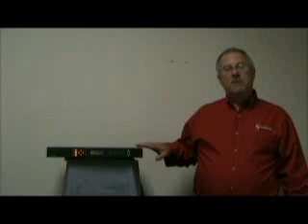From a power standpoint, this unit can be powered via AC, which is approximately 90 to 240 volts, 50-60 Hz. Or you can go with a DC option — there's a 12 volt DC option and a 24-48 volt DC option. You can also get this unit with both AC and DC power: if AC is present it runs the unit, and if AC is lost it reverts to DC, either 12 volts or a wide range 24-48 volt supply.